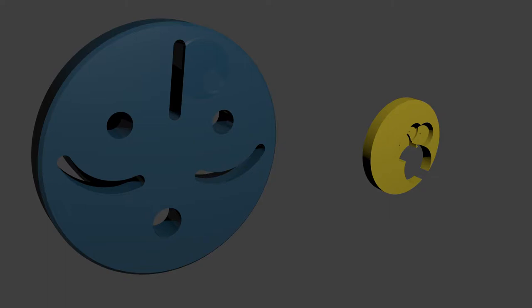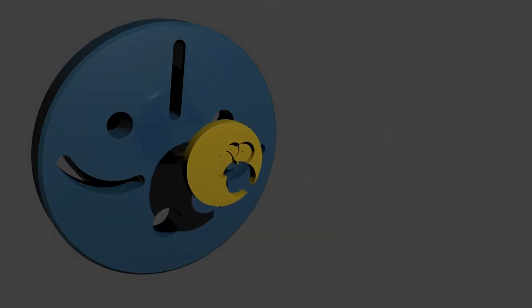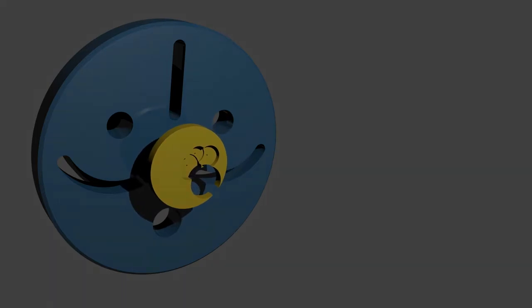The stock for the main plate needs to be mounted a few millimeters away from the plate, with the feature to be machined centered at the axis of rotation. The faceplate includes three clamps to do this, one installed in each of the slots.